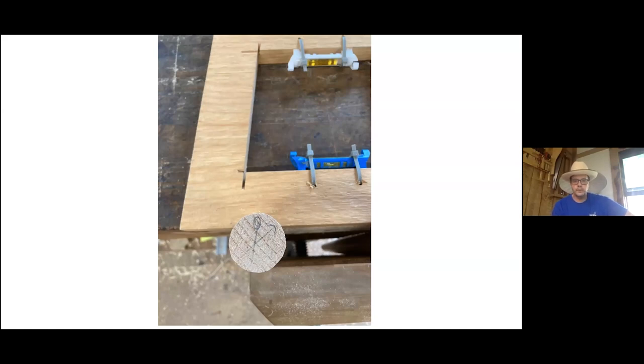Here is the front post. Ideally, as explained in the book, you're trying to look down over the chair representing the round billet of the tree — you want the inside of the tree to be inside. This is a way to get the position of the first rungs on the front posts. The arrow is pointing towards the middle of the seat, and there's another line parallel to the outside of that jig, representing where your drill goes in horizontally. That little circle tells me which side of the post to drill first.